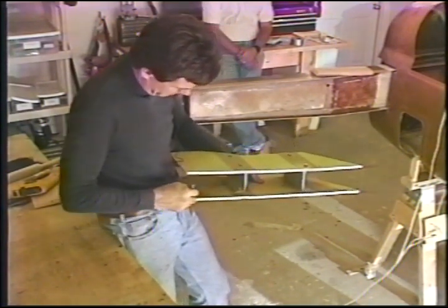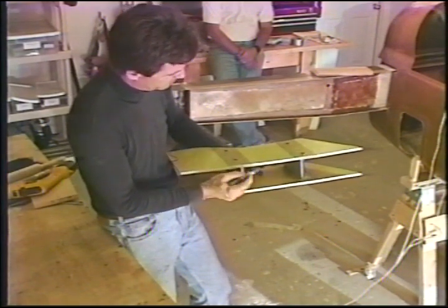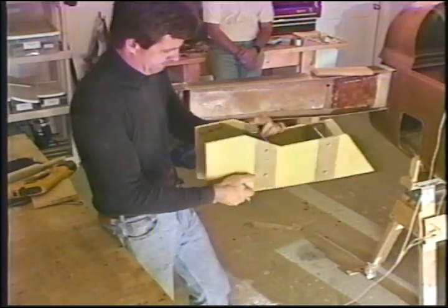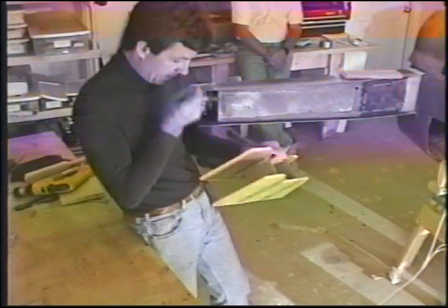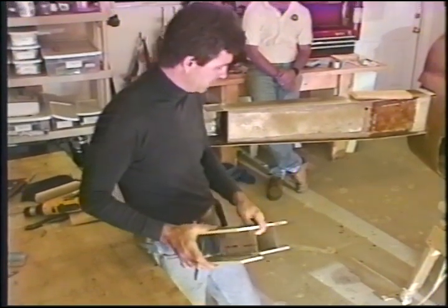We're not going to do much taping on the interior surfaces. There's going to be 4-ply that run from here along the bottom of the fuselage and back up the other side. This whole face we're going to sand, every square inch of it. So it's the bottom and the back on the inboard surfaces that get just a minor amount of sanding, and the entire outboard surfaces. We'll do that prep while our parts are chilling.